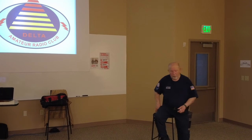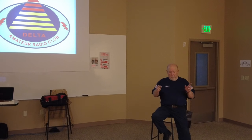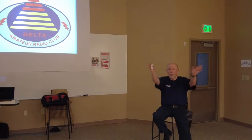Didn't bring anything to draw on the board, so I'm not going to draw. The wire is going from here to the corner of the room. The major lobes of radiation are going to be off this way, okay? And the shorter, like if you put up a half wavelength wire, they're going to be out here. If you put up a 3 or 4 wavelength wire, then those major lobes are going to almost follow the wire, okay?